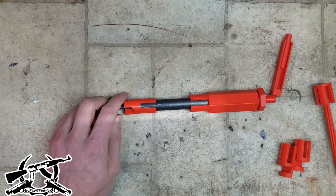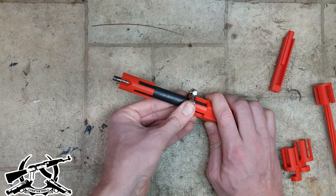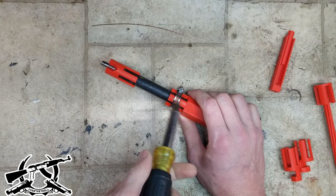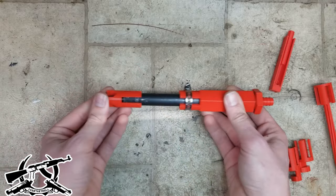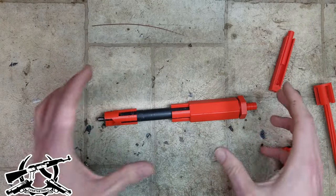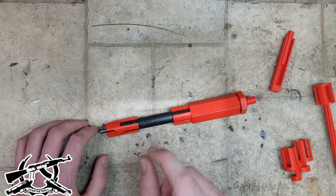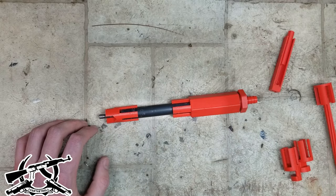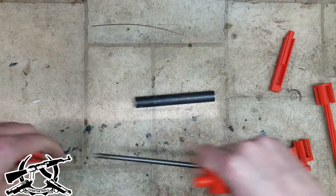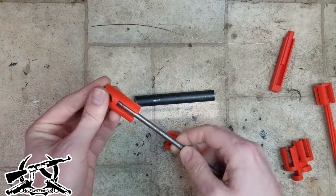It's fairly simple and easy to take apart and put back together. The fingers that stick up off all these tools are meant to have a hose clamp slipped over them — you tighten the hose clamp down and it pinches everything together nice and tight so it doesn't move around when you're cutting. With that, you're fully capable of taking a hydraulic tube and boring it perfectly to be used as a barrel. The documentation walks you through the specifics, but that just comes down to reading and following instructions.